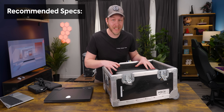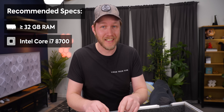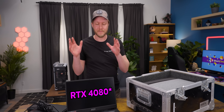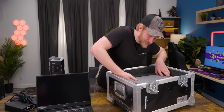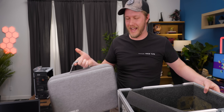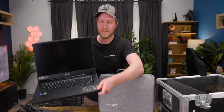It's recommended to have a minimum of 32 gigabytes of RAM, an i7-8700, and a 1060. Now we have greatly exceeded that — this right here has 64 gigabytes of RAM and I think a 3080 or something like that. It's wicked fast because this thing uses so much RAM. It actually stores your entire model as a point cloud in your system RAM as it scans, which goes really fast if you have a computer like this one, and not so much if your computer is a bit more modest.